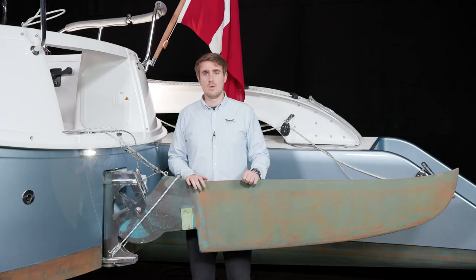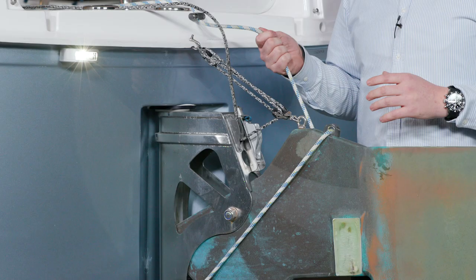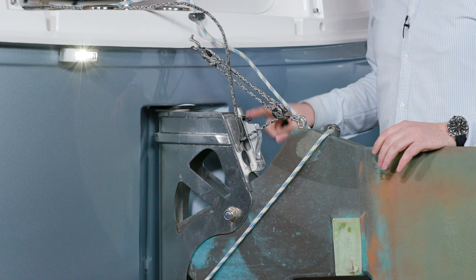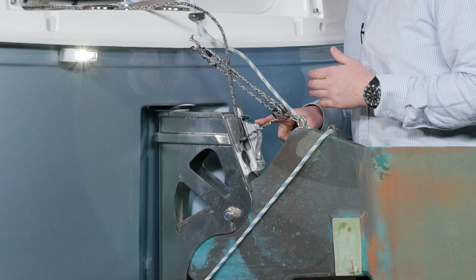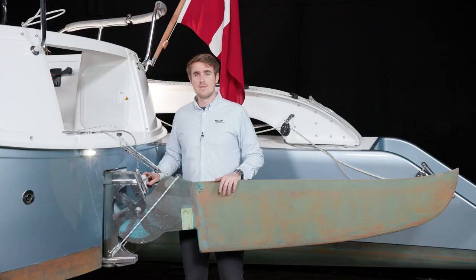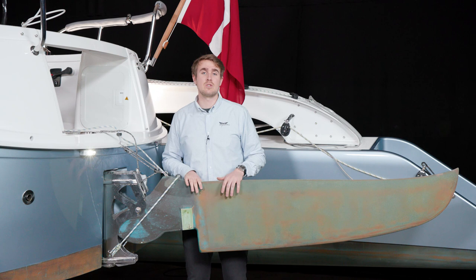When the rudder is all the way down, now the boat is on shore, so I can unfortunately not show it to you, but when it's all the way down, you pull the rudder down line here and put it into this spring-loaded cleat. This spring-loaded cleat gives us a kick-up function on the rudder, which means that if you hit the ground, this spring-loaded clam cleat will pop up if it's exposed to a certain force. Then the spring-loaded cleat will release the rudder down line and the rudder will kick up. Then you will not experience any damages on the rudder if you hit the ground.